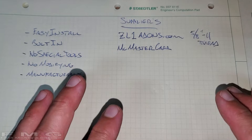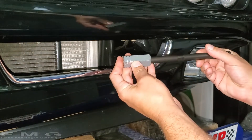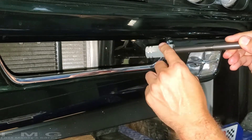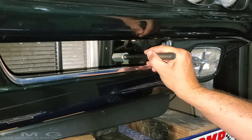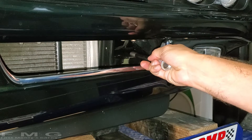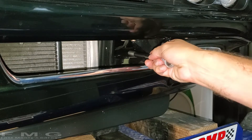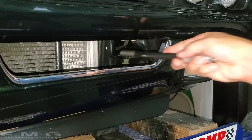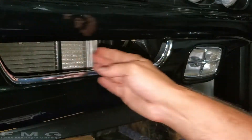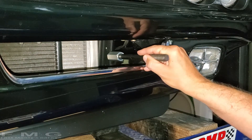So we need to find out where to put this. Let's go to the front of the car. I think I found a good spot. So here's our tow hook and receiver. The tow hook would be threaded so we can actually keep it in the glove compartment, but we're going to fixed-mount the nut. I'm thinking right here - this is pointed straight in front of the car. You can see back in there: there's the top of the frame, the front part of the frame. I'm thinking we come up with a plate that we bolt to the top, because there's a couple of existing holes, and it comes out to about here where we weld on this nut. We're going to concentrate on this prototype for the 69, but I know 70 and 68 have different size gaps. Maybe we'll get lucky and it will fit on multiple years.